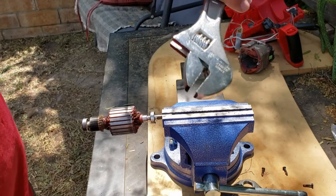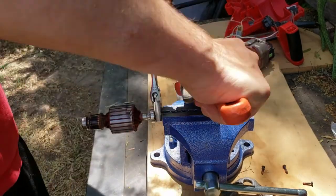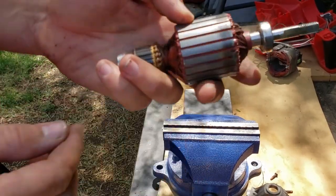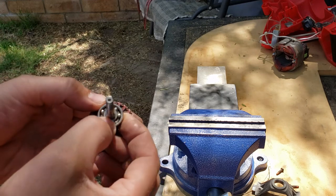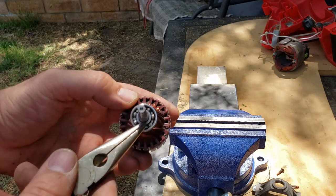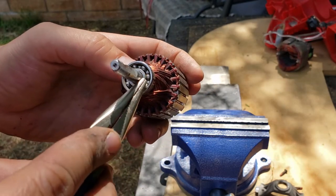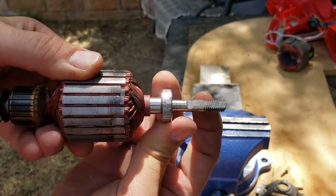I'm trying to keep as much flat surface against the bearing as possible. Put it back in place — it needs to be right next to this guy. When you're hammering it, make sure you're not hammering on the outside ring. You need to hammer on the inside ring, because that's where the resistance comes from the shaft. Make sure the force transfers to the inner ring, not the outer ring — nice and flush, not crooked.